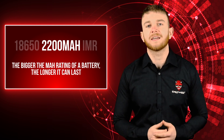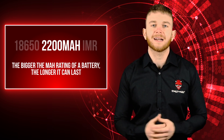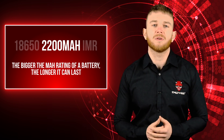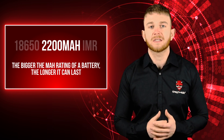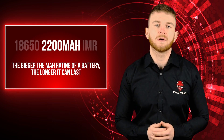However, in the e-cig industry things are never quite so simple. Other factors such as atomizer head resistance along with fixed output or direct current modes will also have an impact on battery life. You can use the mAh rating to calculate approximate battery life, which we will discuss now as we look at Ohm's Law.